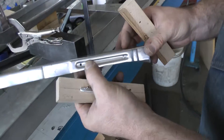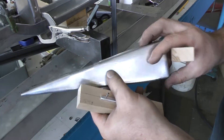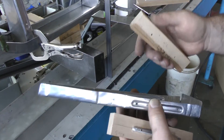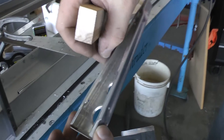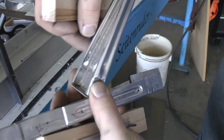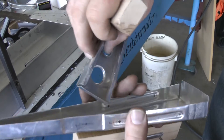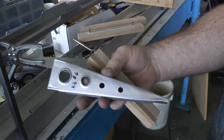These are just test pieces to try different ideas. But before these can be folded up, the grommets have to be put into it. So when you get down to the really small ribs, you have the edge flanged over — it would be pretty hard to get in there and back up the grommet while you seat it. So they all have to be done on the table before the ribs are actually folded up.